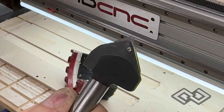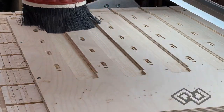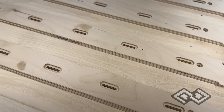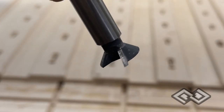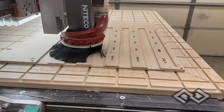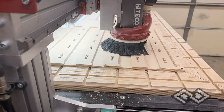This 45-degree V-groove bit will add an angle to the bottom of the cleats. You can see how the panels are taking shape. We just have one more cut to do on the top using a 45-degree dovetail bit — and this bit is surprisingly hard to find, so if you're looking for it online, make sure to check the link in the description. This 45-degree undercut is the angle that all of the holders will rest on.